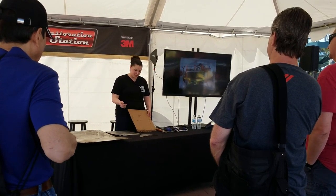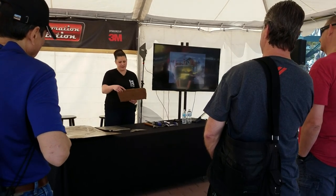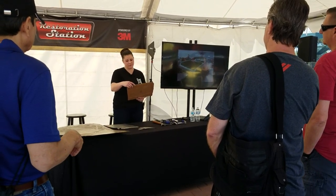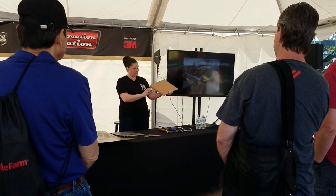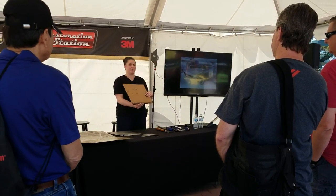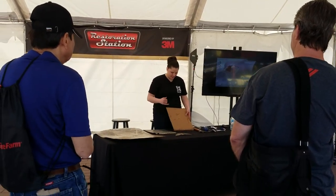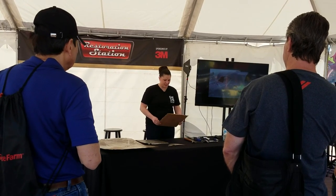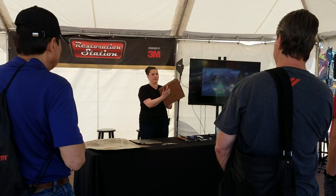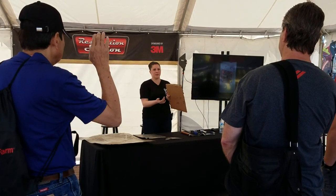Then I take measurements — I measure the actual opening and transfer that measurement here, marking the distance. That says 15 and a half height overall, 14 and a half height to a 45-degree bend, and that's the 45-degree bend. Cardboard's nice because you can slice it and do a partial bend and it's still together. Then I mark the middle — this is just the top width. The little dots mark where there are spot welds, because that bottom 90-degree bend would have holes drilled so I can do spot welds to the structure at the base of that bend.